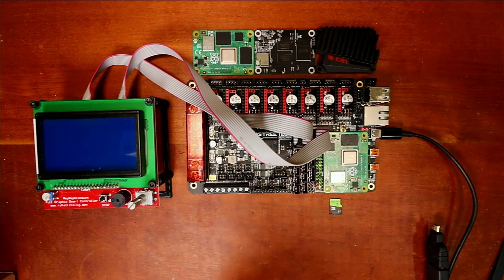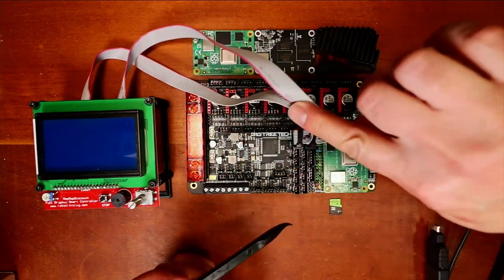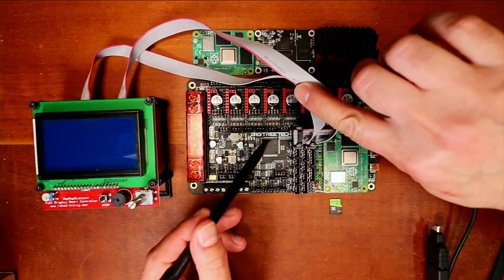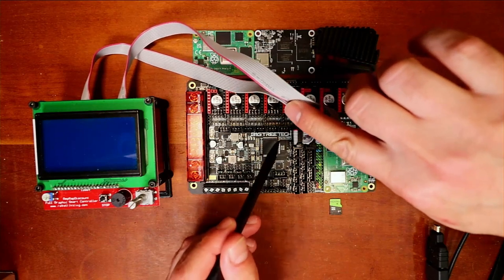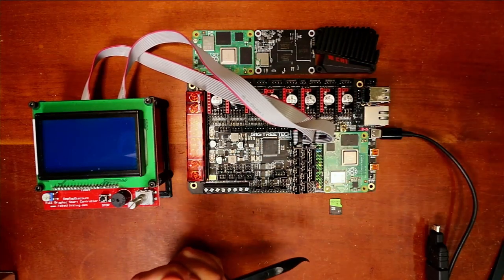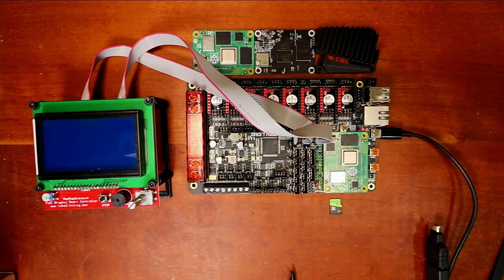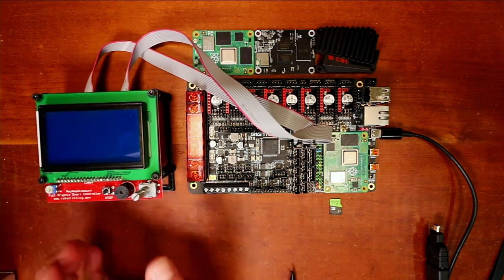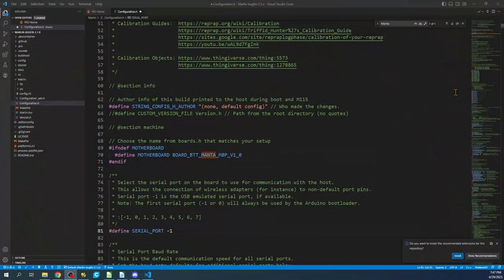And if you're ever looking for the actual processor, I know it's kind of hidden right now, so let me move this over. If you don't know what your processor is, you can read it right here, or you can look at the silkscreen on your board on the top and the bottom. So let's go back over to the computer and set this up for the RepRap Full Graphics Smart Controller for the actual display. So on the desktop, we're going to search on RepRap,